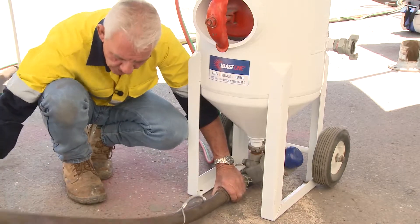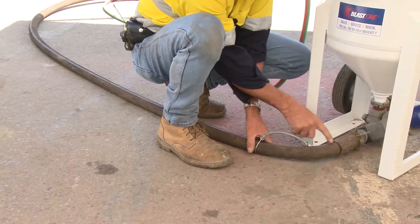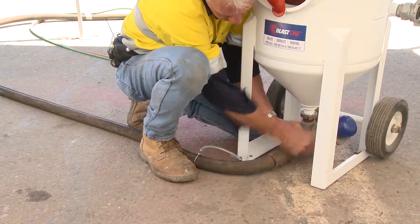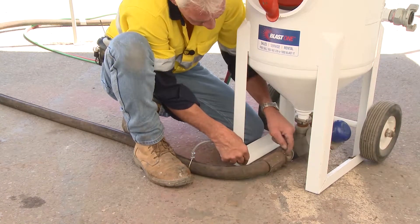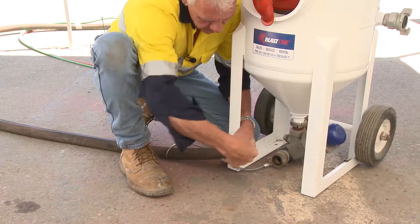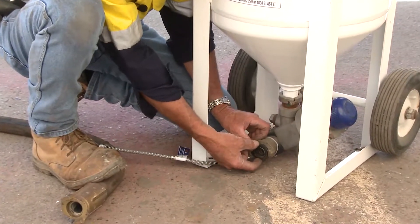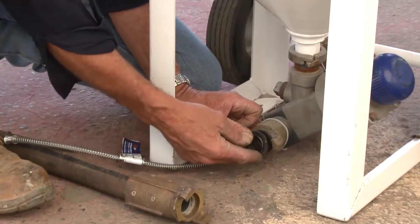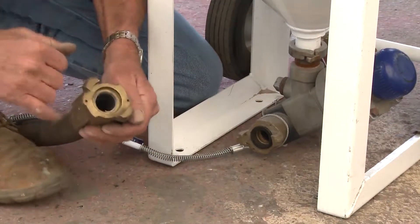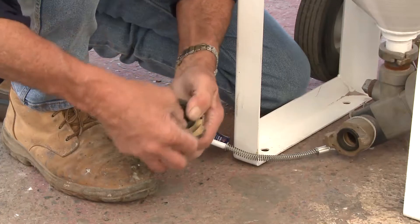However, if you don't have a nice big long radius on this hose and you pull the hose around like so, you can see here that it's starting to create a restriction in the hose, and consequently it's creating unnecessary torque or thrust on these gaskets inside. So by pulling it around like that, it's putting torque on those gaskets. What that does is the gasket is no longer seating square — if you twist that hose to one side, this gasket here is squashed down that side and lifting up the other side. Ultimately the air will start to pass through that gap and cut those gaskets out relatively quickly. If it starts cutting the gasket out, the recess in this fitting and the claws and the face edge are all undermined by the escaping air and the consequential grit that comes with it.